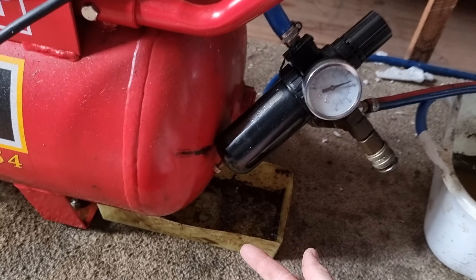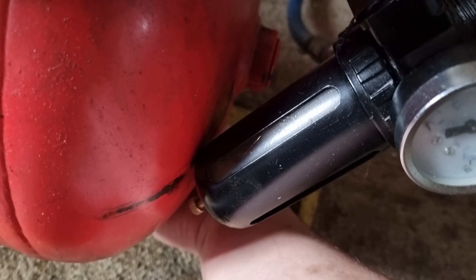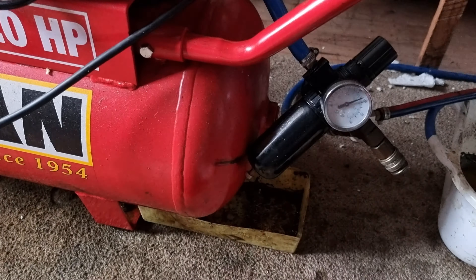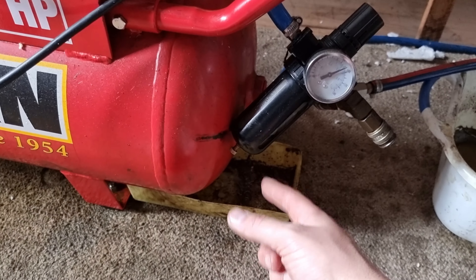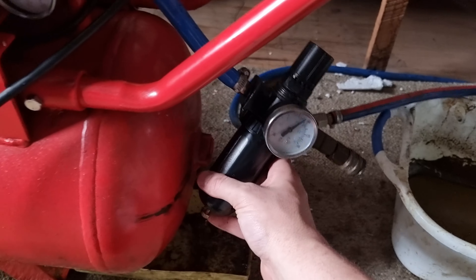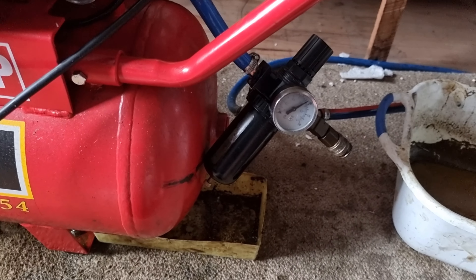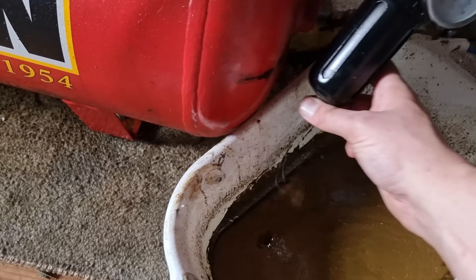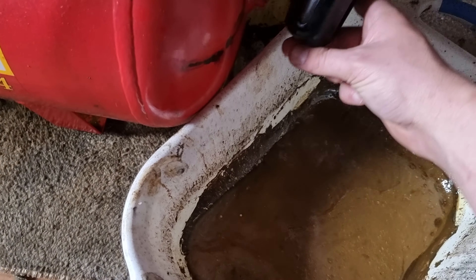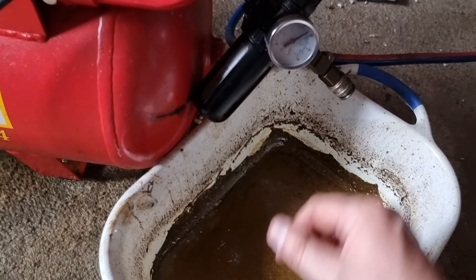What I'm going to do is crack this vent just a tiny bit — just so it drips just a tiny bit — so that over time when it's been shut down at the end of the night, the residual pressure will cause the moisture to drip out and it will sort of continually dewater itself. And I think this probably needs to be dewatered too — yeah, there's a whole bunch of water in that as well. It's not sitting upright, which means it's not actually doing its job properly, which is probably where a lot of the water is coming down the line.